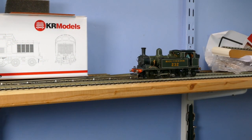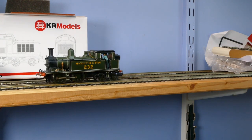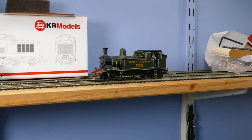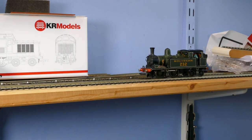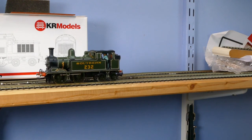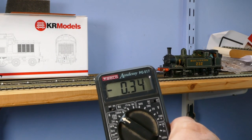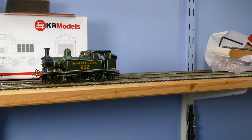She's on the track, all together - let's try. Notice we've got a little bit of a stiff wheel there - something to check as well. Not far off being correct. She's still drawing a bit, but we're down to 300 milliamps now. All that remains is to ease that little wheel, then she'll be ready for a test downstairs - give her a long run and see what happens. Perhaps she'll even make a feature in a video. Hope that's been of interest - stay tuned for more very soon.